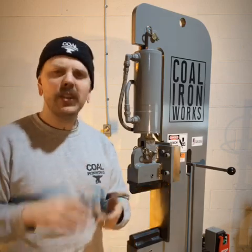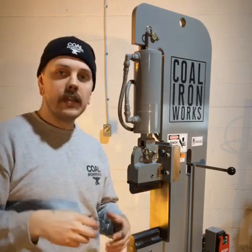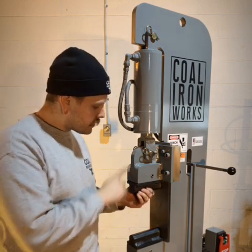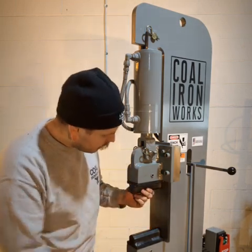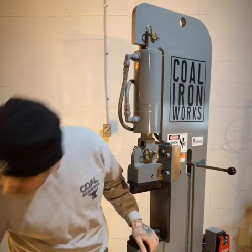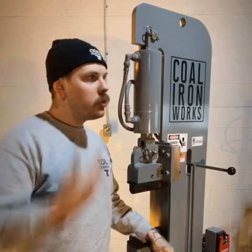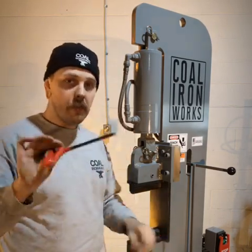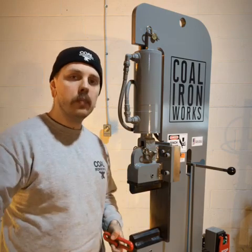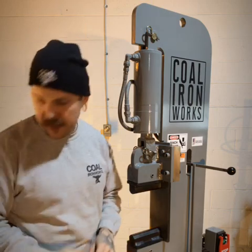This is even more critical in a punching operation where you're going to be physically pulling on those die tenons as you're stripping the punch out of the bar that you're forging. I've made sure that the front of my dies are aligned top and bottom, and I've torqued these by hand. For most general forging sessions, 30 to 40 foot-pounds applied with the T-handle should be plenty. Only if you're getting movement and need more force would I recommend a larger wrench.